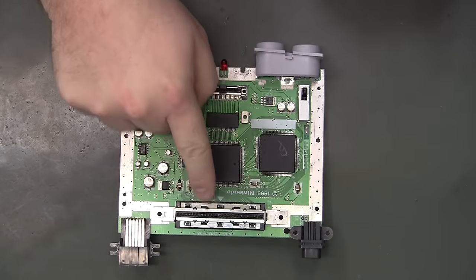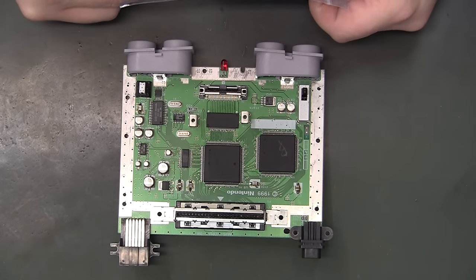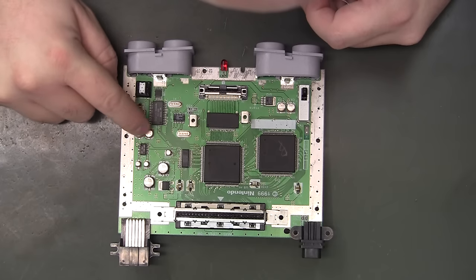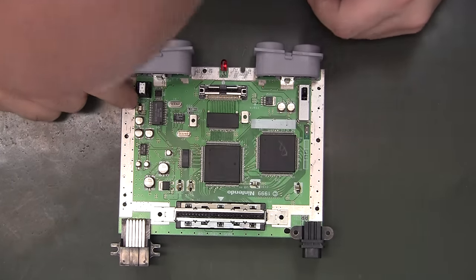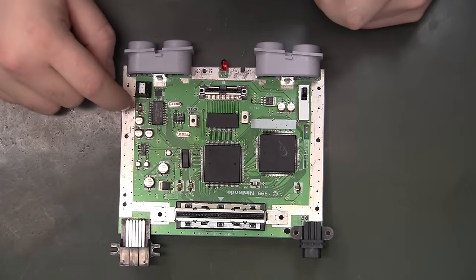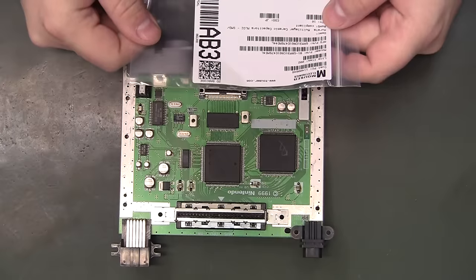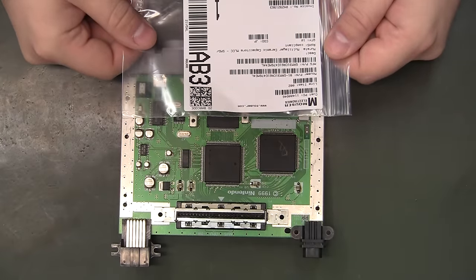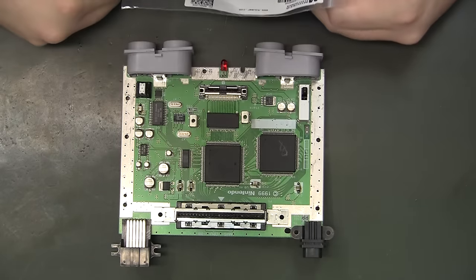So you see the cart connectors back on there. For the 33 microfarad cap, I've got three of them on this board. I'm going to do this one first. I think, let's see, what was this? 142. That was the single and the only 12 volt capacitor. And the Mouser caps that I got, doesn't show, but I know they're 47.